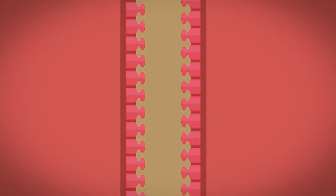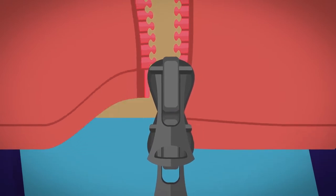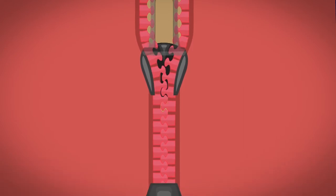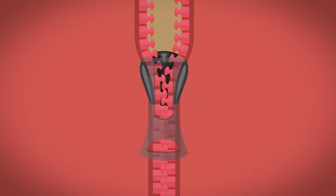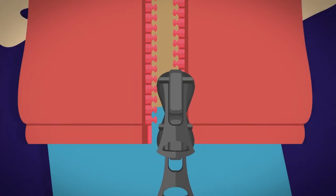So that's how you open and close a zip — but how does it work? How do the teeth lock together? To show you that, we need to look inside the slider. Each side of the zip has a row of teeth with gaps in between. When the two sides of the zip are lined up, the teeth on one side are opposite the gaps on the other side. Inside the slider there are two bits called wedges with grooves in them — one wedge is higher than the other. The teeth of the zip fit into the grooves of the wedges, and when the slider is pulled up it presses one row of teeth on top of the other row of teeth, making the teeth lock together tightly. When the slider is pulled down, the teeth are pulled apart and the zip is opened.